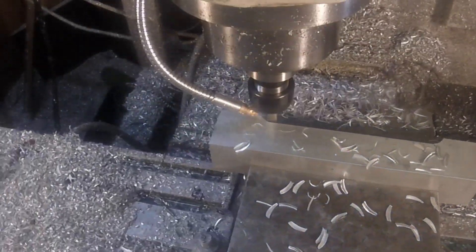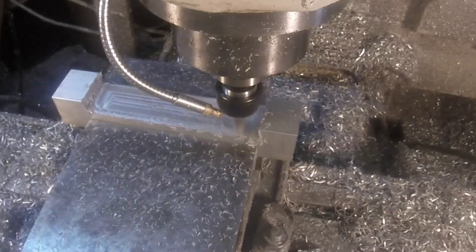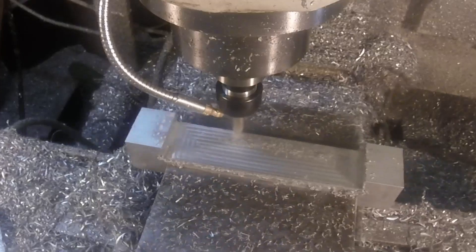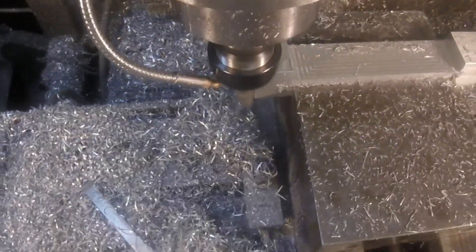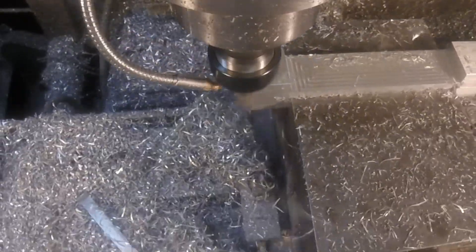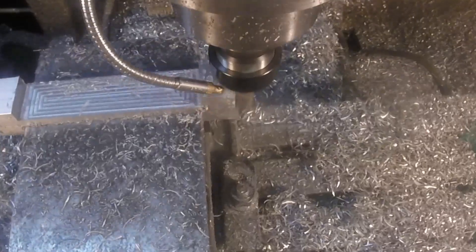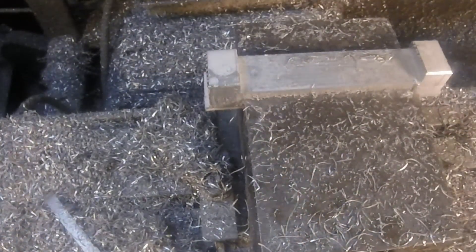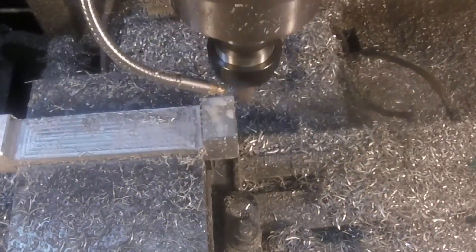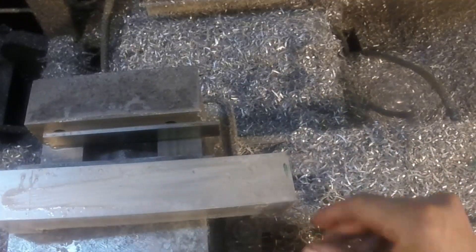This project starts with a piece of one and a half inch solid square aluminum bar, just hogging out a bunch of material. This is a finishing pass — it's going to serve as the main body of the vise. Those edges are just rough cut on a chop saw, so I have to clean those up as well. Now that I've got the top portion done, I flip it over and machine out the bottom.